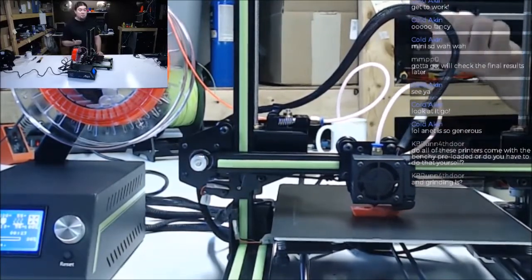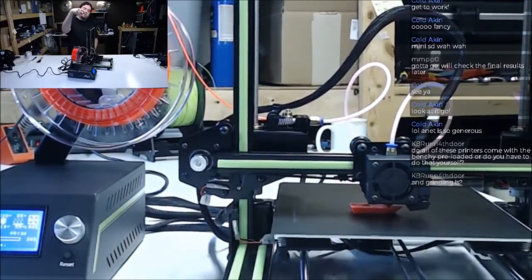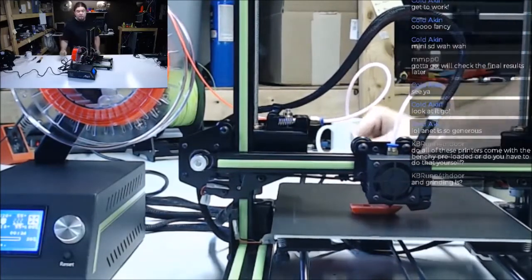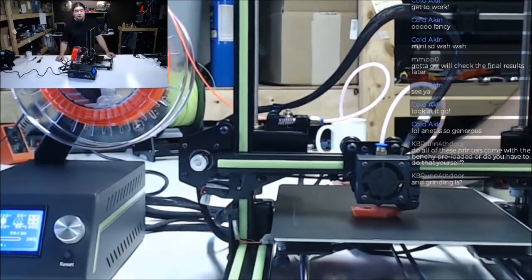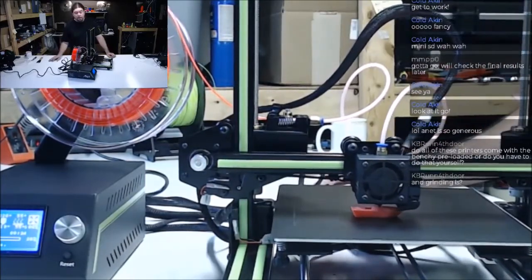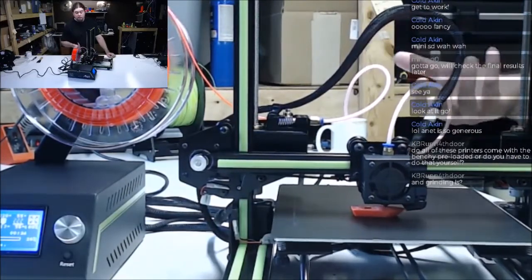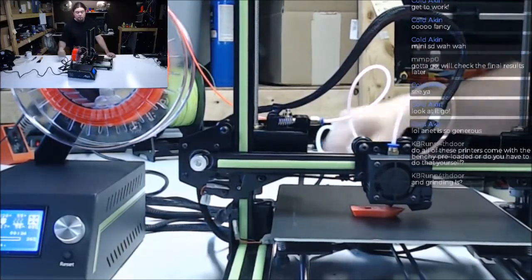And you could have a clogged nozzle. That barrel being the wrong size can cause the filament to do like a U inside the barrel and cause it to not get through there smoothly. That can cause this kind of thing. But most of the time when I see that, it's speed. The firmware settings inside the printer are set too high. Or the nozzle isn't hot enough to melt that type of plastic. If it's too cold, it'll grind as well because it can't get it through there.